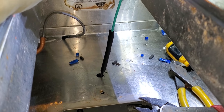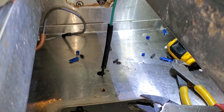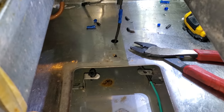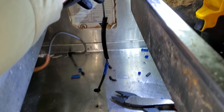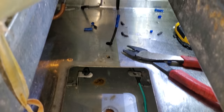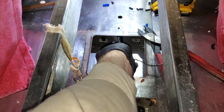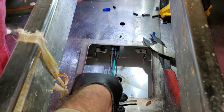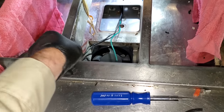This is the ground wire — the first one — then we'll do each one after that. This is a serious pain in the butt. Here's the power wire — we're going to do a butt splice, extending them, then add the end kit. Yeah, this is a chore, but it's going to go okay — one bit at a time. We got them all through with heat shrinks, and now we've got this to work with to extend the wires. I just need to connect this connector and put an end on the ground.